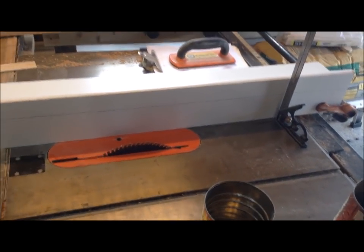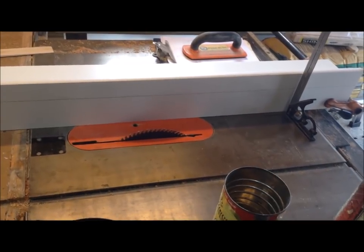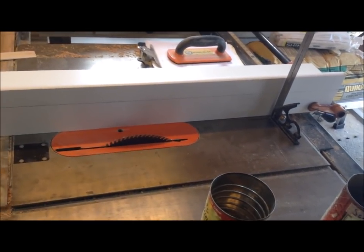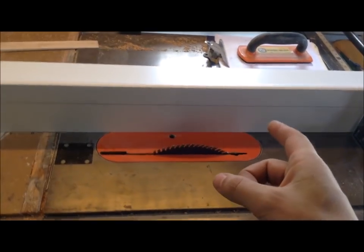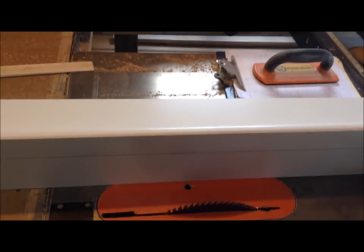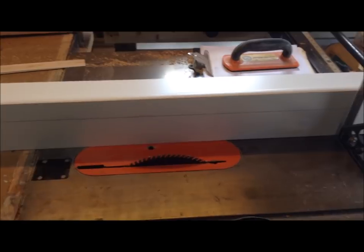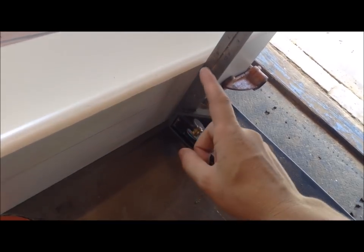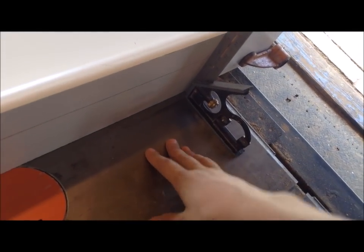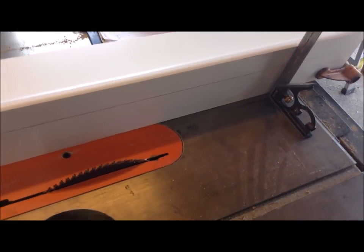With the front piece cut, I'm now going to cut the back piece that will sandwich this in place. From the table top to the top of my fence is two and a half inches, so I'll cut a two and a half inch piece. Then I'll cut a piece four and three quarter inches to bridge that gap. Those three pieces sandwiched around my fence — I put a pipe clamp here just to hold everything in place. I only clamp the two outer pieces together; this one's free floating. I ran a pencil along the top part and flipped it to the outside so I know when I countersink my holes. I'm keeping this at its six foot length and I have two other jigs that use this sandwiched fence mechanism, so I can trim it down later if needed.